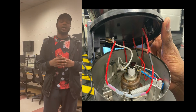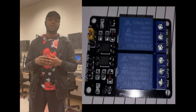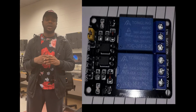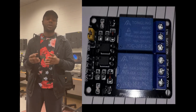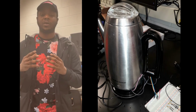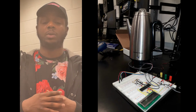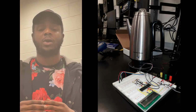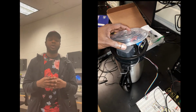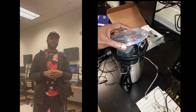The second hurdle that we encountered was working with the pressure sensor, which is for the safety feature that we added to our design. The pressure sensor works with a range of 20 grams to 20 kilograms, but our safety level works in a range of 0 to 5 kilograms. Because of this large difference in range, we were unable to calibrate the pressure sensor into giving us accurate readings whenever we took measurements of the percolator jug.